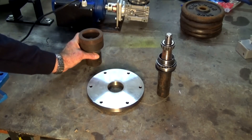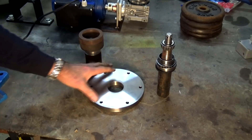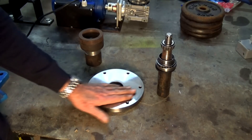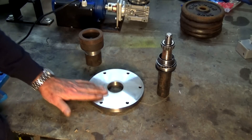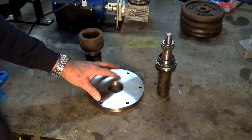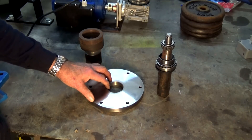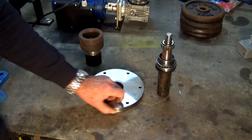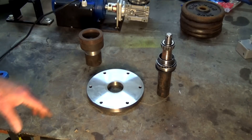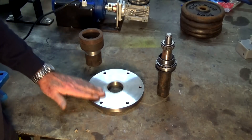I should mention, I don't know what this steel is. It was just part of a shipment of scrap that I got from a local metal supplier, and I turned it with a carbide insert and I couldn't believe the finish on it — it's really, really nice. A lot of the steel I use around here is just cold rolled, rubbish quality — cold bending steel — it turns terribly, stringy and horrible, you never get a good surface finish on it. But this stuff came out beautiful. It sort of restored my faith in my lathe and my carbide inserts.